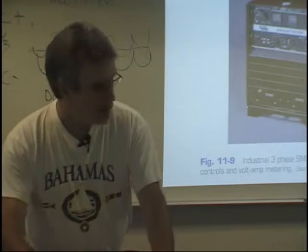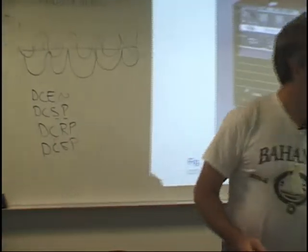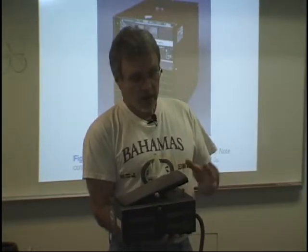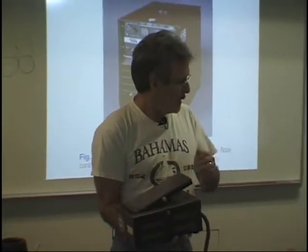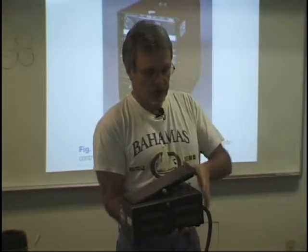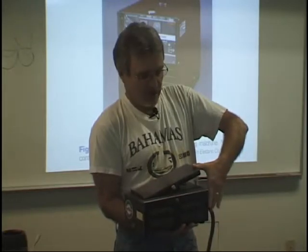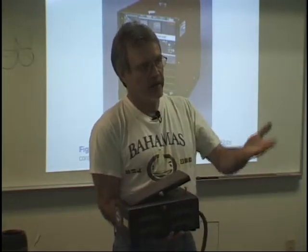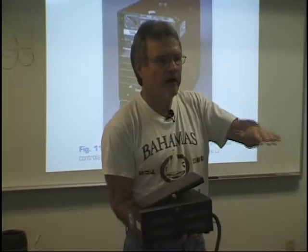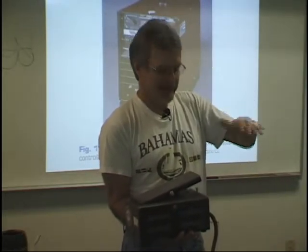Okay. Another way to do it is with one of these. These are used a lot for gas tungsten arc welding. Does anybody know what this is? You guys ever seen one of these? I've seen one. Well, if you go on and learn TIG, you can use this, and it looks like a gas pedal. The more you press it down, the higher the amperage goes. The more you let off, the lower the amperage is. So it gives you really fine current control at an instant.